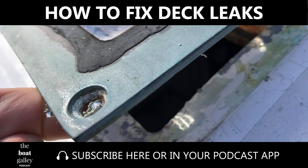Once you've decided what sealant you're going to use, remove the fitting very carefully. Sometimes the sealant you've used will adhere so well to the deck that it becomes really difficult to get off. So you just have to watch that you don't make this project bigger than you're expecting by being very careful about how you remove it. You may actually want to run a razor blade between the deck and the fitting to loosen any sealant so it's not pulling up the gel coat or the deck with it.